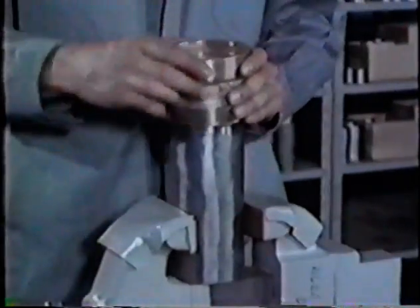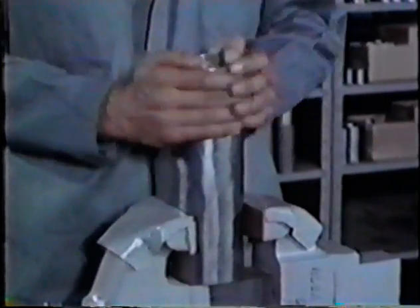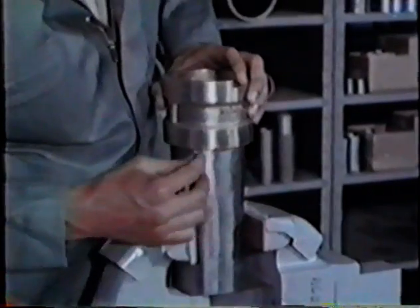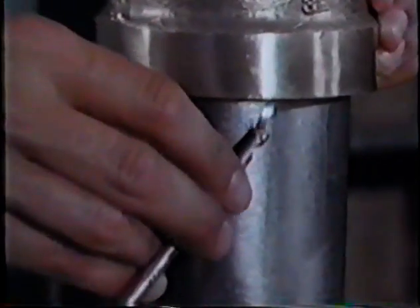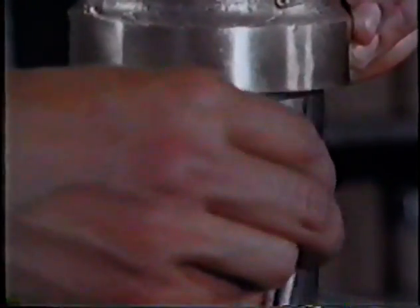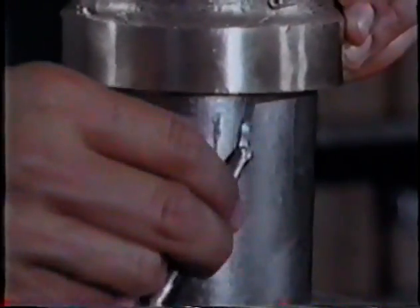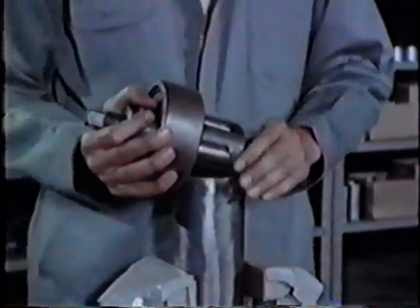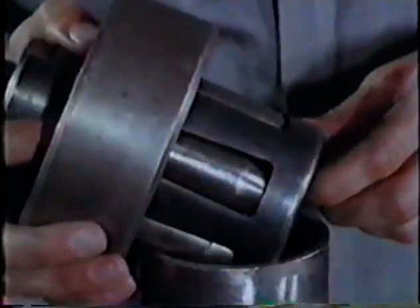Smooth down any high spots in the pipe. The pipe should go in and seat without forcing and rotate easily, but not loosely. Check the fit with a feeler gauge, correct for the size of pipe you're using. If the gauge slides in, the pipe is undersized and needs expanding. Use the Wilson expander or equivalent tool.